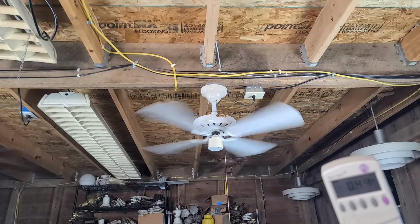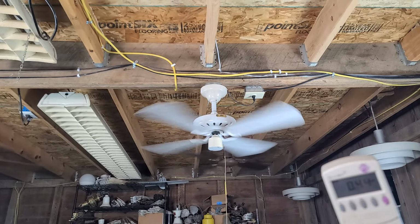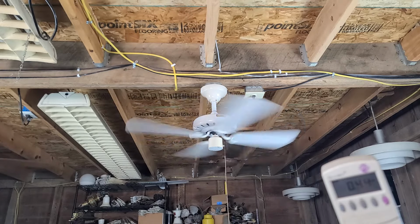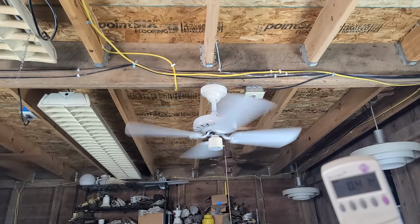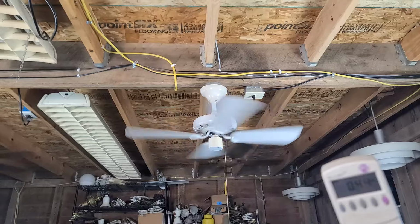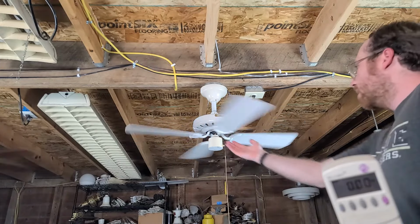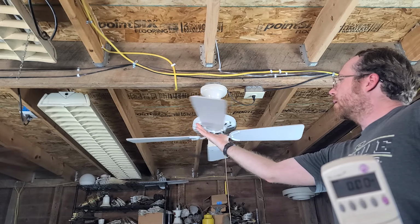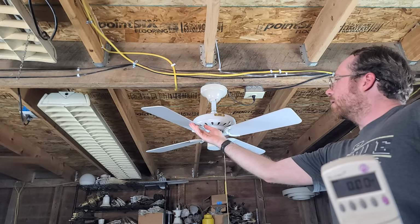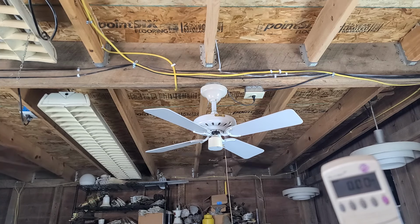Sometimes I wonder if the power coming into whatever facility we're working in is just having a good day, because it really does seem like it. It's just a less choppy waveform or something. I don't know how that's possible, but it definitely gives that impression sometimes. Felt a lot of consistency today. Yeah. It's helped having the Variac. I would have never thought to use that on a daily test basis. I thought we would just use that for the CF28 and then put it back. It does help making sure the voltage is steady. It's been very smooth. It's been very useful.